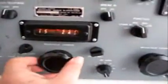It sounds like Qantas has got through. Let's move on to a bit of AM searching and I'll explain the basis of the AFC. So here we are back at the CV-157, currently in single sideband reception mode, but you can actually resolve AM signals with this if you lock onto the carrier. We're up here at 15 MHz. You can hear the beat of the carrier, and if you focus on the meters and adjust the carrier for maximum, close enough — you can now engage the AFC. It will now automatically lock, and you'll see the AFC indicator meter actually jiggling.